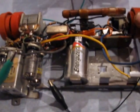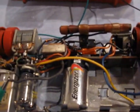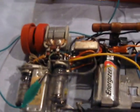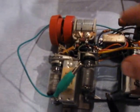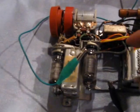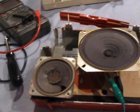But we figured it all out. Usually on these, there's a pair of 300-ohm resistors in the B-plus line for the 3V4, and they're 5%, and they usually go bad. I'd replace those. I'd replace two caps in it. The speaker was totally trashed — it just didn't have any output at all, so I've got to find a 2-inch speaker for it somewhere.